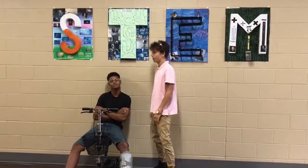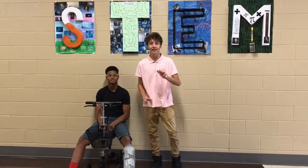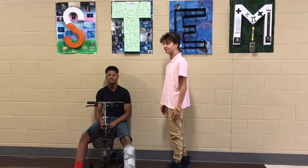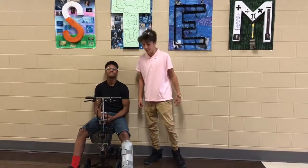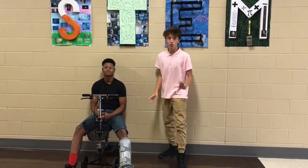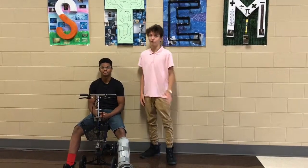Alright. First of all, I'm gonna give you some general lab safety. If you have long sleeves on, make sure you roll them up so they don't get caught in the machine. You do not want that happening. Second of all, you want closed-toe shoes. Any open shoes, toes, and sharp objects can puncture your foot. Third of all, you always have to have your hair behind your head, because you do not want your hair getting dragged into the machine and your face getting pulled into the table saw. That'd be awful.